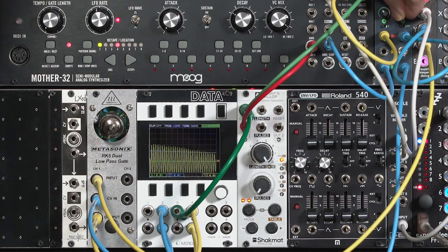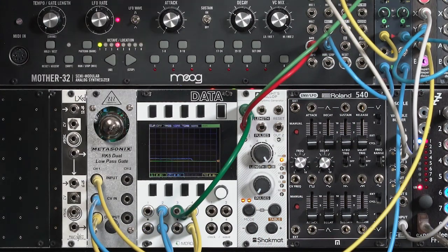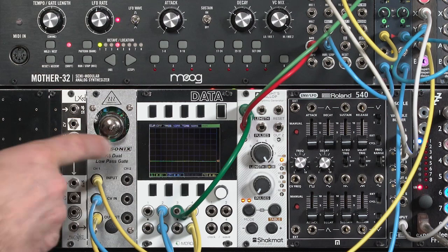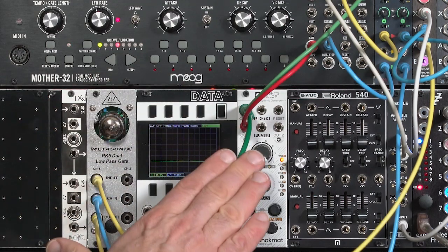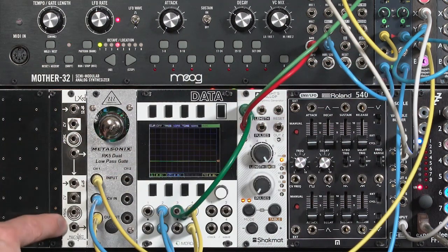Even though I have over 3 volts coming in, only a low level of audio is coming out, and it cuts off at around 2.5 volts. What this means is that it's going to ignore part of the envelope. As soon as the decaying envelope falls below that 2.25 to 2.5 volt threshold, this low-pass gate immediately falls into its own release time — it ignores the envelope. From that point on, it goes through its own natural decay. So it gives you a very different envelope than just feeding an envelope generator into a normal low-pass gate.